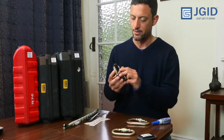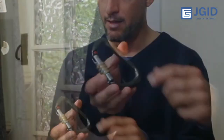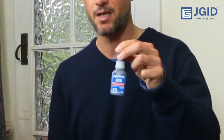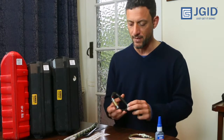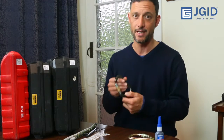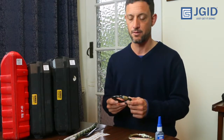Here's the true gem — we also have an RFID chip that can be glued onto carabiners or other metal equipment. We recommend using Loctite 480, which can be bought in various hardware stores, though you may need to order it in advance as not everyone carries it in stock. You can also order the glue together with your tags. It's a really cost-effective way to tag your carabiners, do inspections on them, and track where they've been.